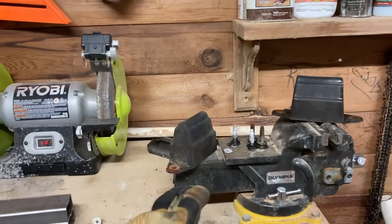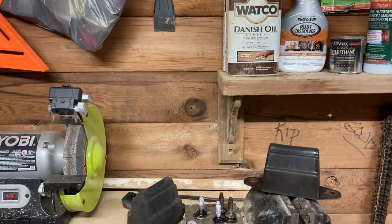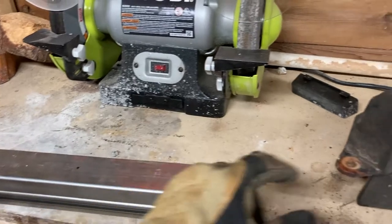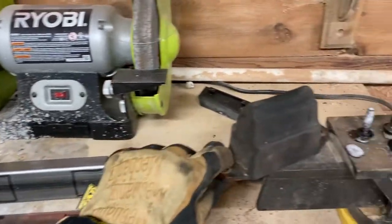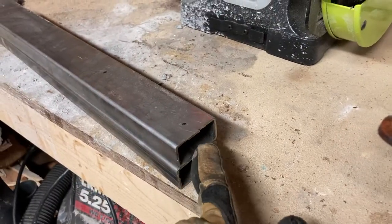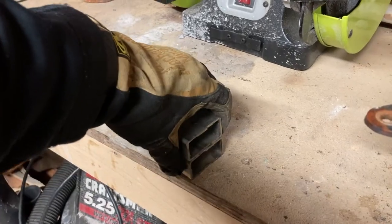It's out, now we can get to fabricating the extensions. We've got our parts out and our old bolts soaking in rust dissolver — I prefer Rust-Oleum rust dissolver, works great, eats away the rust, and when you put them back in with some anti-seize they'll last forever, good as new. This is 2x1 10-gauge stock. We'll drill holes to mount up onto the base of the bump stop and have enough room to access nuts and bolts. We're cutting D-sections out and sandwiching it together so there'll be enough space to get in with your wrenches and not get stuck with your wrench permanently attached to your car.